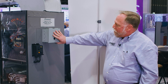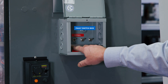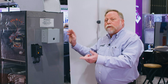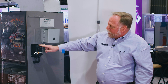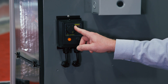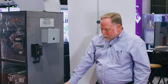On this side is the fault switch box — you can lift the lid, activate any of the four built-in faults, close it back up, and the student won't know what you did. Students can also do faults for each other. In the box on the left side, there's a controller that adjusts the voltage to the indoor fan, so you can change the RPMs just like a dimmer switch on a light.